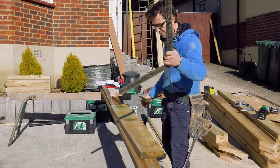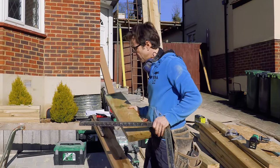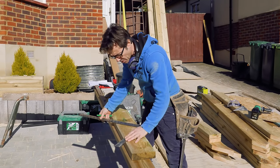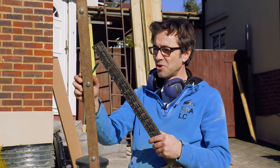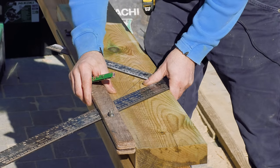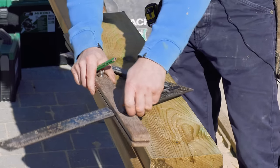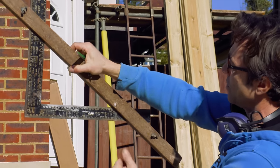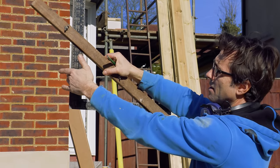Let's work out the pitch. I take my roofing square — that was a level line, so that is the rafter slope I'm working to. It wants to be 35 degrees. That's what we asked the steel worker for, and that's what we need for a plain tile. I use a special modified section of Iroco that I made — it's like a fence. Although I won't go into exactly how the roofing square operates, it's basically like a protractor. The centre is a fixed point, and all the angles go around in a semicircle. So that's 35 degrees, that's level, that's plumb — a plumb cut and a seat cut.